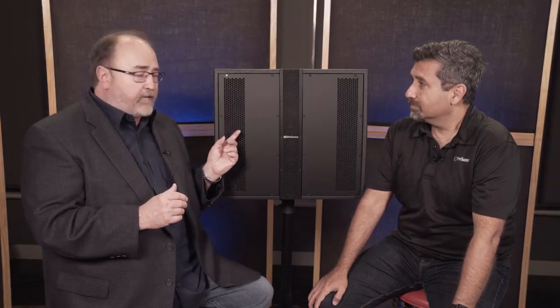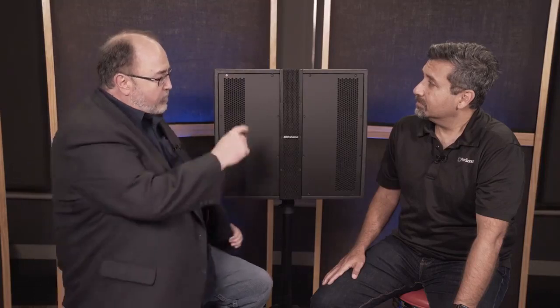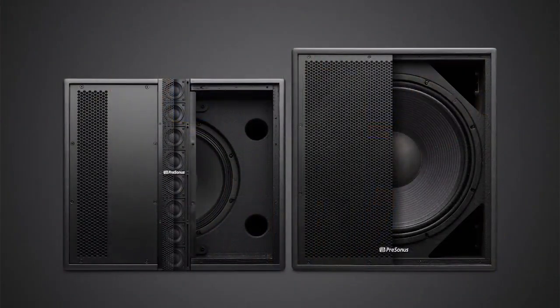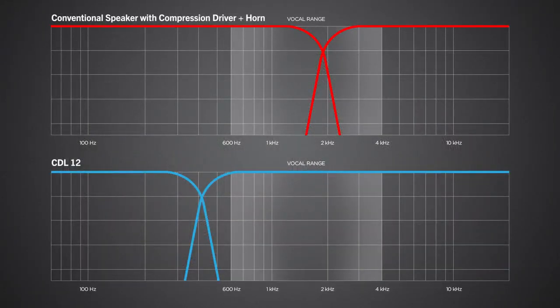The pattern that they have may be asymmetrical, so it's a little brighter on one side and a little duller on the other. For us, we really wanted something to have a nice, smooth, symmetrical pattern. So what we ended up doing, we used a 12-inch speaker for bass, but we also used 2-inch drivers in the top — there are eight of those 2-inch drivers. It can make a really powerful mid-range, high-frequency output. Our crossover point is able to cross this over down at 420 hertz.